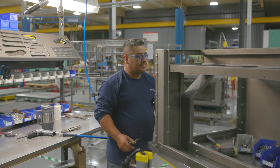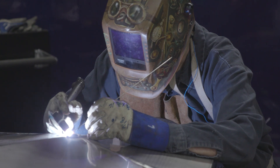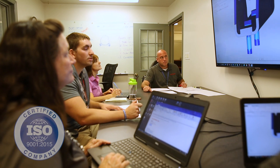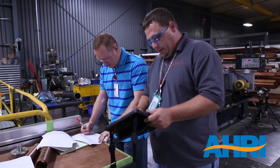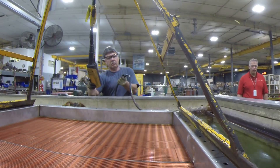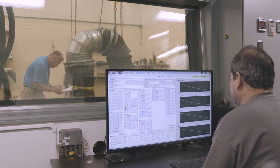Manufactured to Marlowe's high standards, the life of a Stratomizer will often exceed the applications that use it. Marlowe is ISO 9001 certified, and all Stratomizers are sized in accordance with AHRI standards. We go through a strenuous quality inspection process, followed by testing of coils and pressure leak testing. We also offer ASME certified coils, which cover pressure vessel certifications for heavy-duty industrial applications.